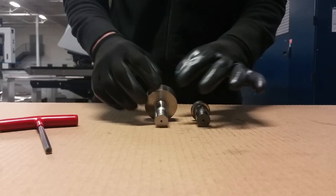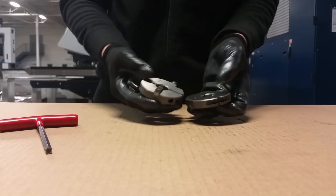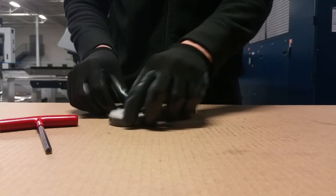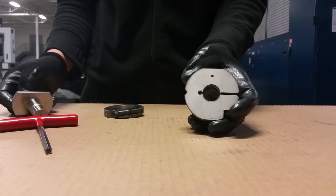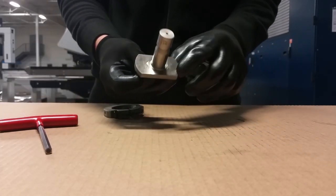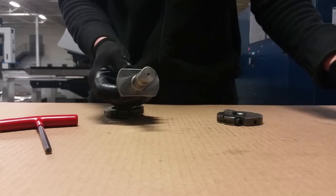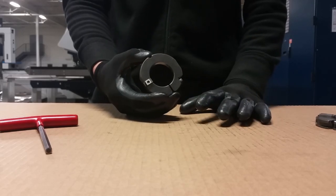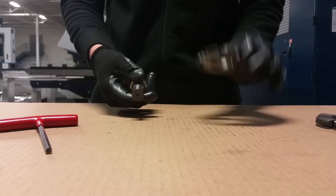As you can see, the shape of the body is slightly different. As I mentioned in the first tutorial, we have three kinds of alignment rings. For this punch, this alignment ring is suitable. For this alignment ring you can use a punch with this shape — it doesn't have the basic round; it has a big flat surface. You can use this one or that one. And for this alignment ring, there is one more kind of punch on the market — it's for heavy duty, so the punch has a bigger body.